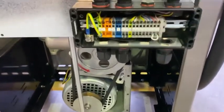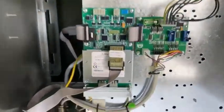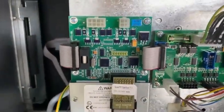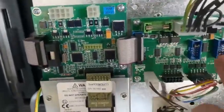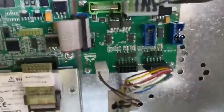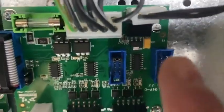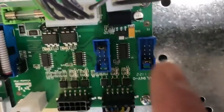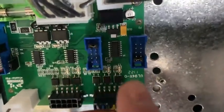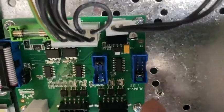On the reverse side of the electronic head in the dispenser are the electronic boards. Over here you've got two jumpers and two jumper boxes. At the moment the left-hand has the jumper at the top and the right-hand has the jumper at the bottom — these are the two pulse outputs. Changing these jumpers changes the number of pulses per meter.